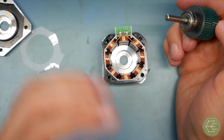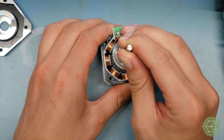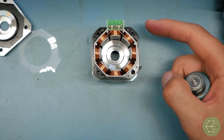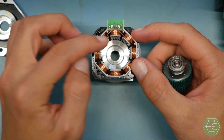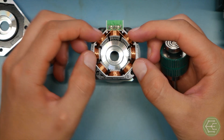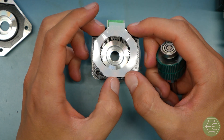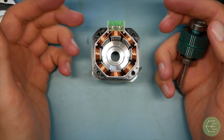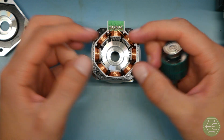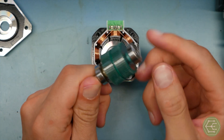The person who designed this was incredibly smart. There are simple yet completely relatable problems the designer needed to solve — some relatively precise machining needs to happen; this slots into the stator. There are two sets of windings — wire inside a metal enclosure. They use a little plastic sheet to guard the electronics from the metal, and use that as a bobbin to wind the electromagnets.